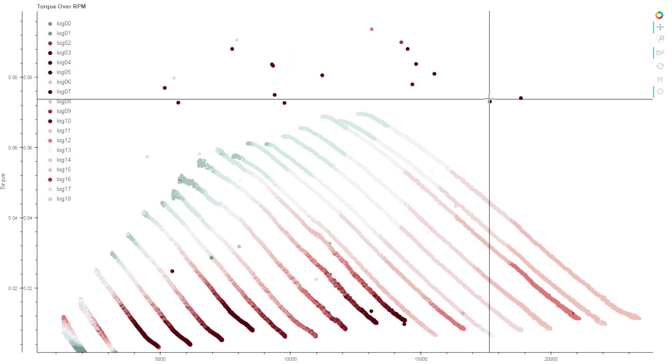And that brings me to the second major point in doing bench testing: repeatability is everything. You have to be able to do the same test multiple times and get the same result each time. If you can't repeat your test and get a repeat of the numbers, your numbers are not worth anything.